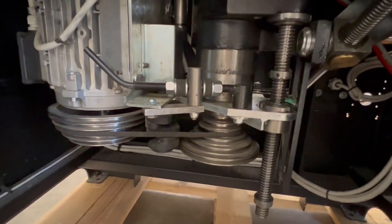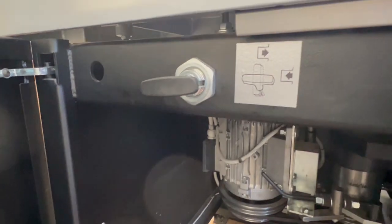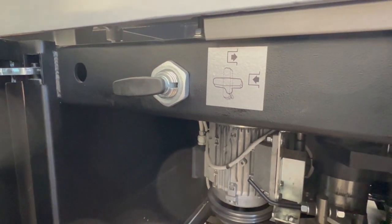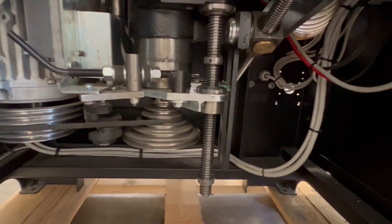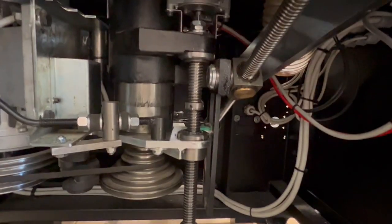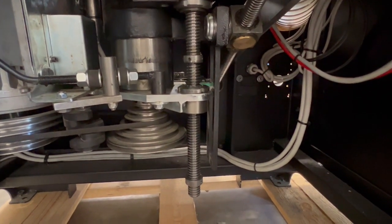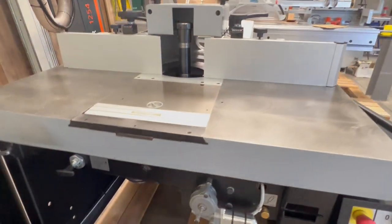This machine's got a quick change nut, but there's also a plunger there to lock the spindle. On this machine you don't need to lock that off as it has the quick change. While we're in here, this is your rise and fall thread and your tilt for your electronic movements — just make sure they're all greased up, keep on top of them.